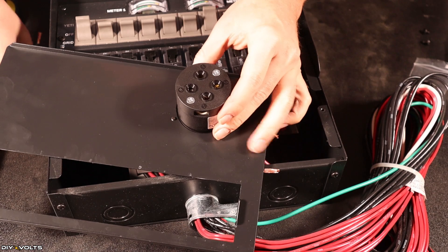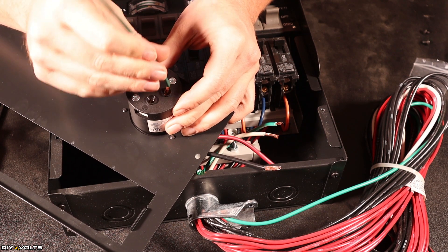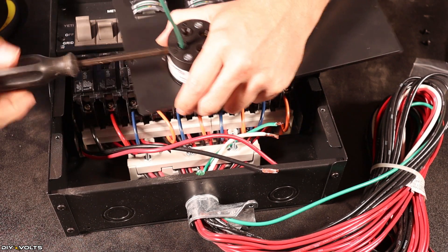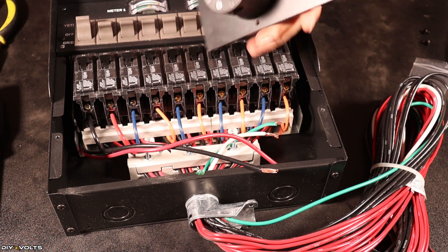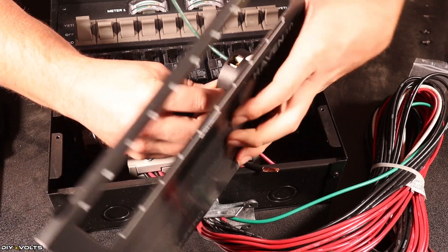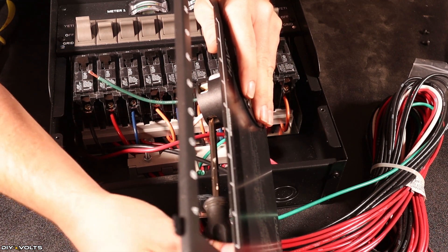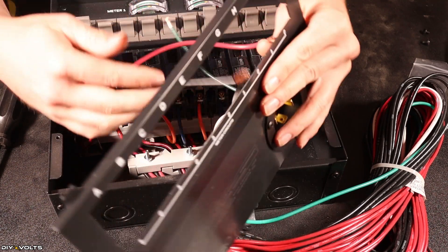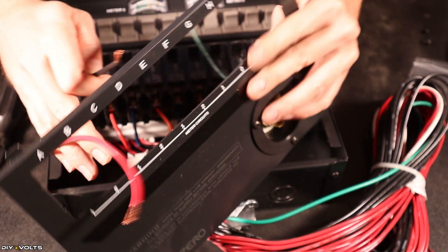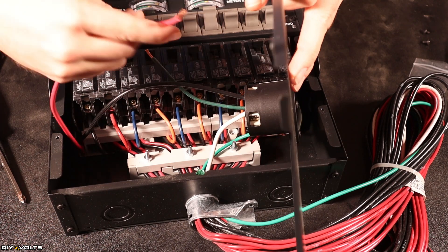Let's begin wiring. On the back, I'll find the ground screw and place the green wire in that hole, then use a Phillips head to tighten that down. Across from that is the neutral, which is the white wire — I need to plug that in here. Lastly, we have the red and black wires. The black wire is a little shorter in this model, so I'll put that closer to the switch, and the red one goes up under here on the bottom.